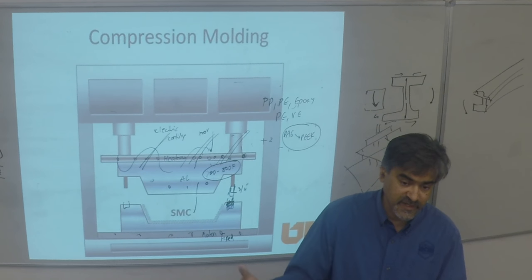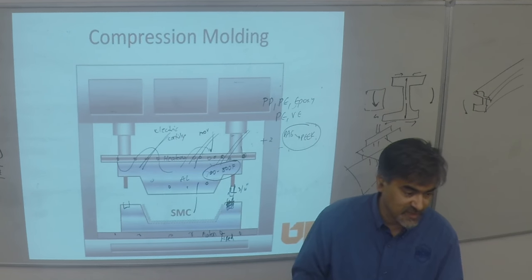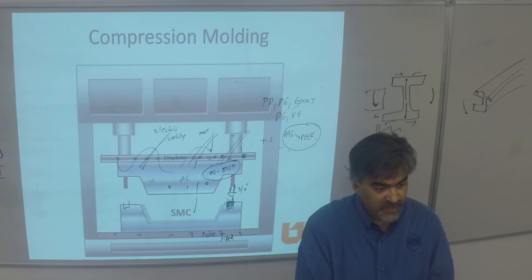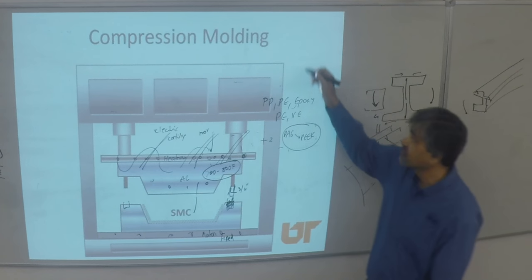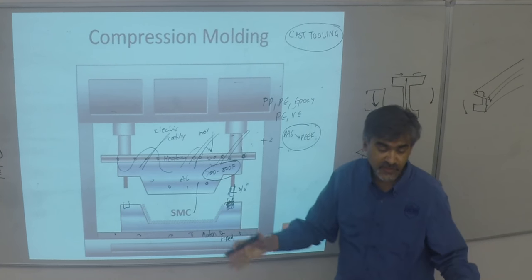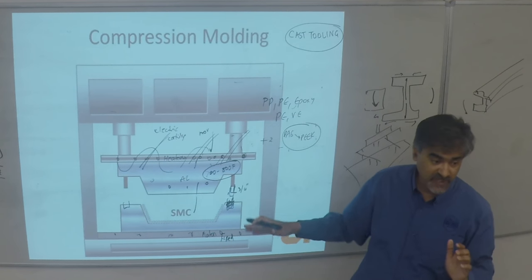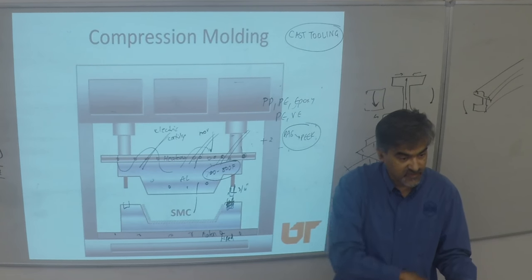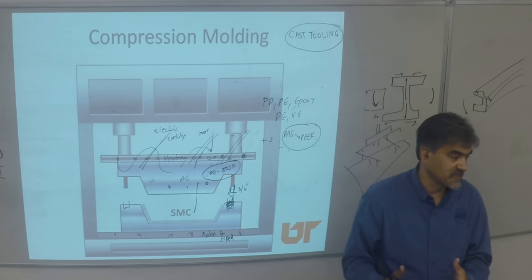The tooling can have heating on the platen or directly on the tool. There's an NPT connection that goes through a quick-disconnect hose for plumbing the tool to the hydraulics — that's how you circulate your oil. The thermolator unit has a pipe that feeds to the tool, so all you do is pull one tool out and put the next one in.